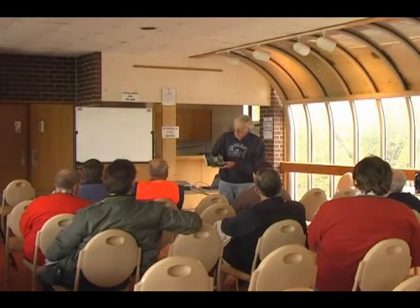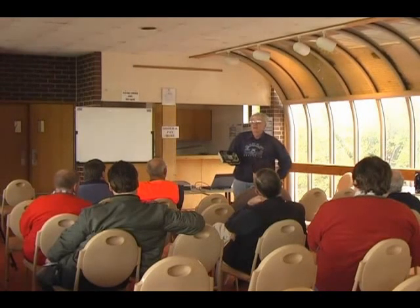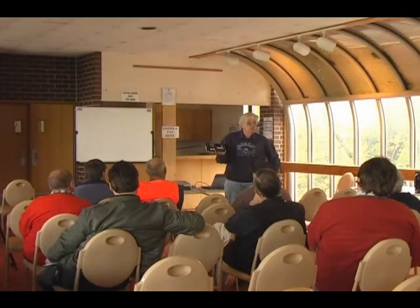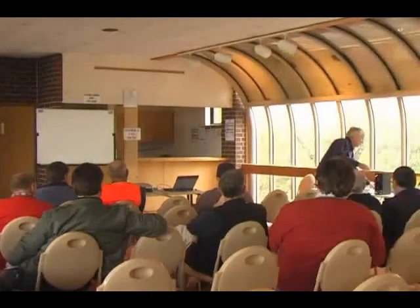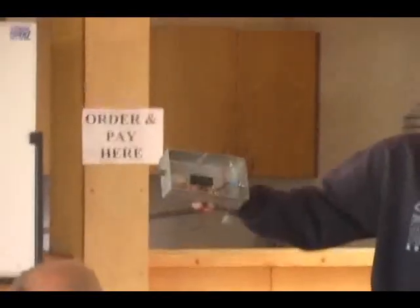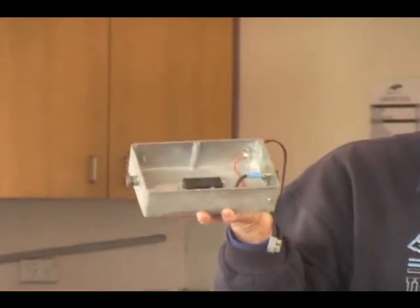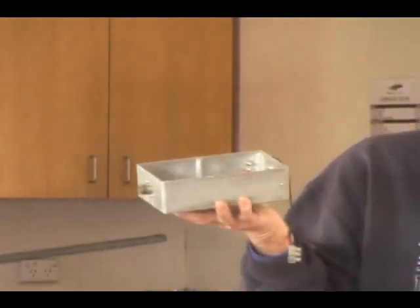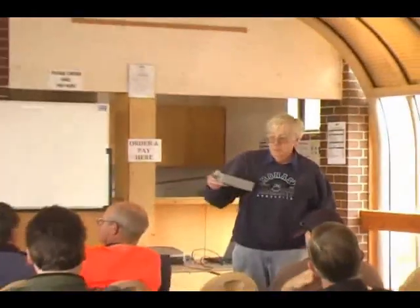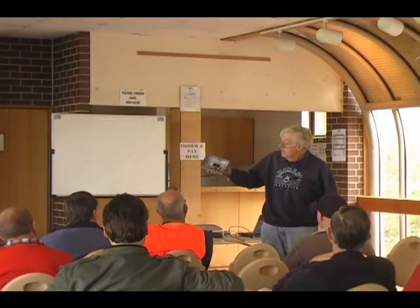That's a very good option for ATV — it gives out about 80 milliwatts. And if you get one of the Minikits little RF amps, and also the 18-watt amp, you're up to 18 watts. That's basically an 18-watt amp that died on me. If you run ATV, you need this on a fairly substantial heat sink, and you need to fan the heat sink as well. But you can run them 24 hours a day, 7 days a week, no trouble — you just wouldn't want to run them in a plain die-cast box. That kit is available from Minikits. If you look at the kits from the United Kingdom, you'll find they're a lot more expensive for the same thing.